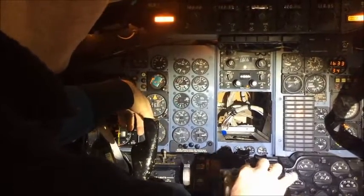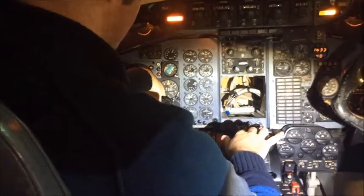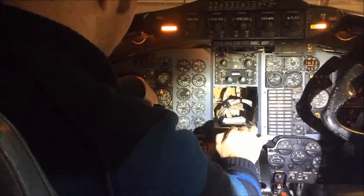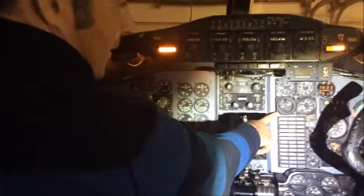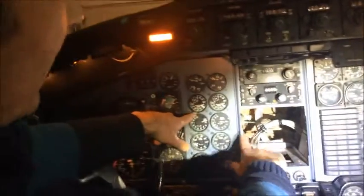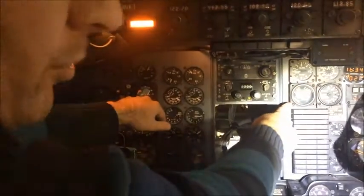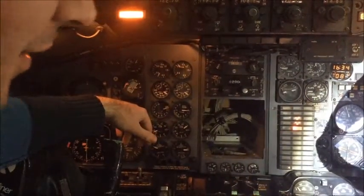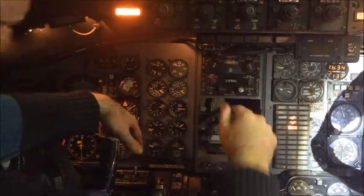There's something else that's working — it's pretty cool. We have a synchroscope over here. I actually haven't done anything to that instrument. What happened is I'm simulating the tach signals that go to each tachometer, and once I sent the right signals, the synchroscope started working on its own. It jumps around a little bit, but I'll bring the power up and split the throttles so you'll see that the synchroscope does actually respond.